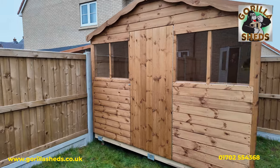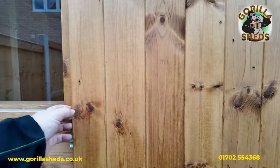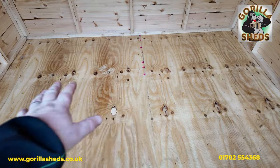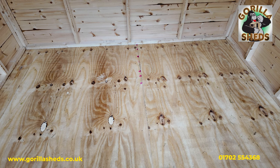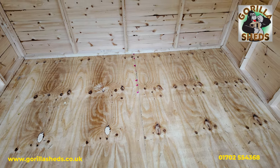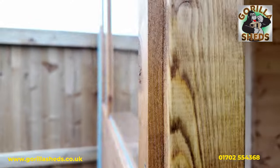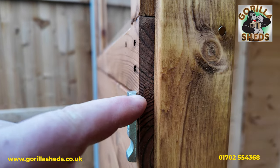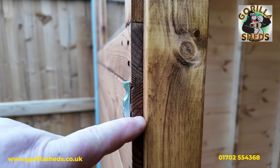That 4x2 frame is then clad over with, let me go inside, this is 18 millimeter exterior grade plywood. So that's the floor of the shed, and it's just massively strong. You're not going to go through it. So the cladding on this shed, this is 16 millimeter. This finishes at roughly 12 millimeters thick.